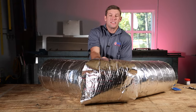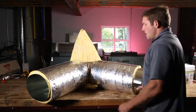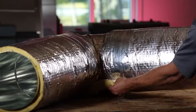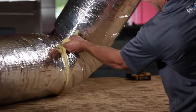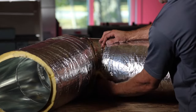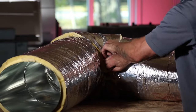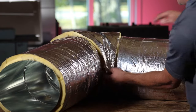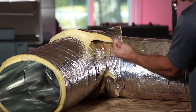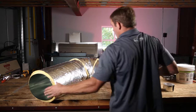I use doubles on the tape, which is extremely excessive, but it looks so good it's worth it. I'm left with this center section right here. I could actually just pull this tight and leave it — it wraps into my pattern a little bit and comes out slightly too far. I could trim that, but I think it'll be fine either way. There's a little allowance when over-wrapping a vapor barrier; I'm just going to tuck my insulation a little bit here, bring the other section over and tuck that in. This is a difficult seam without adding a lip, so I'm just going to use a thin strip of duct tape to get it tight. Anytime you use duct tape when there's tension on it, you've got to staple it.